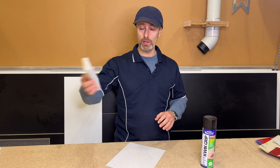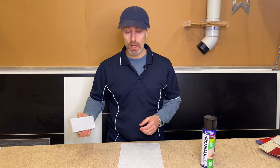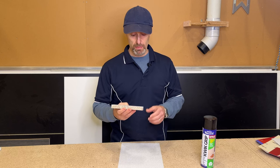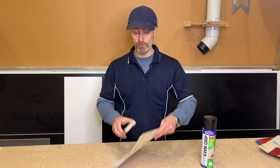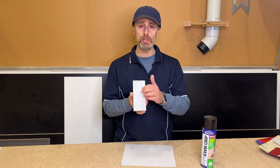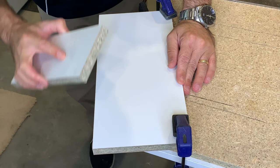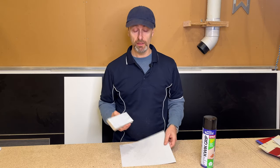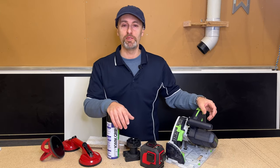I have these made up in different sandpaper grits. They're great for doing a quick chamfer on an edge or just taking off sharpness. They don't hurt your hands, they won't roll or slip, and because the sandpaper is glued on you get a nice flat, even sanding surface — especially good if you want to take an edge off or do a chamfer. Really handy in the workshop, quick and easy to make with offcuts and sandpaper.